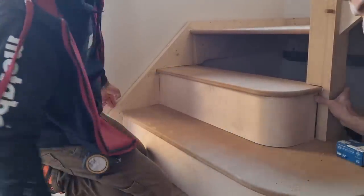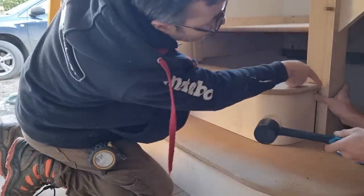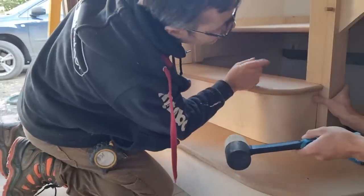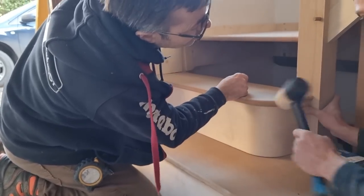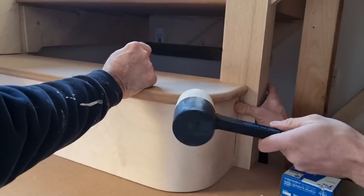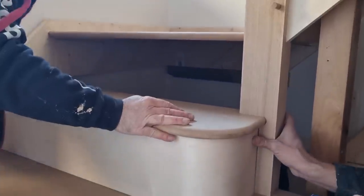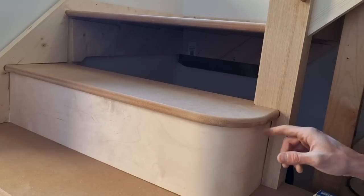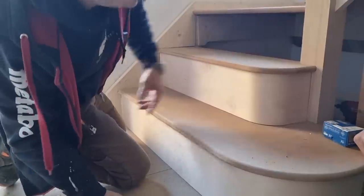Hold on a minute. I'm gonna put a bar behind this string. Just watch that. That's all you need to do, tap it in line. That's it, now just gentle taps, just until you see that go in the groove. Now in. A bit more. A bit more. That's it. Pull my arm round. That's it. Now what we'll do, we'll get a couple of shims behind there to hold it while we clamp it all up and push it towards you, yeah?